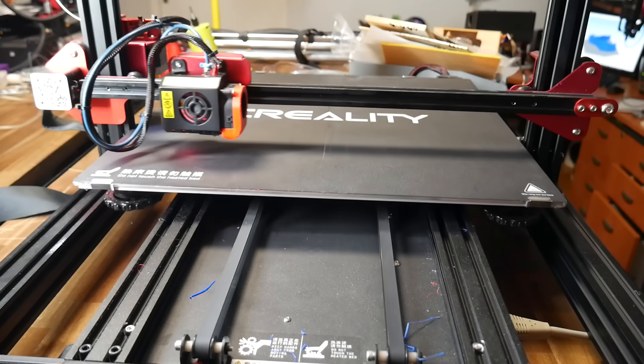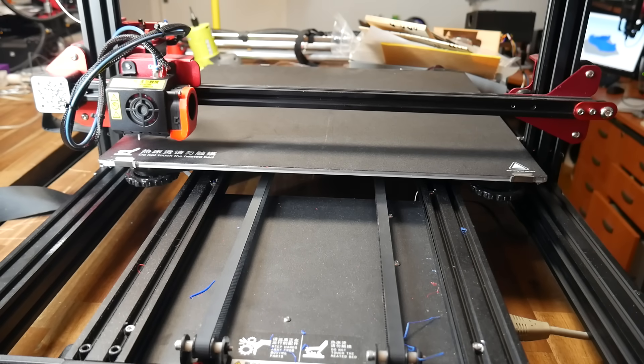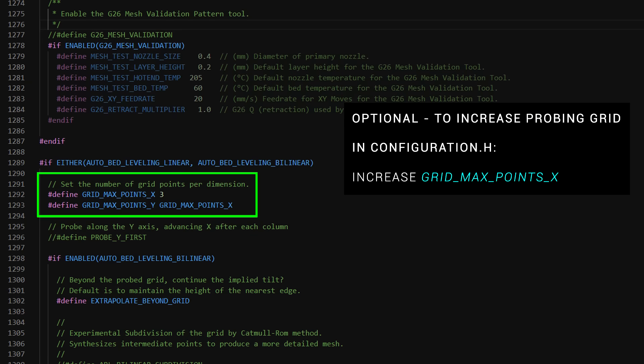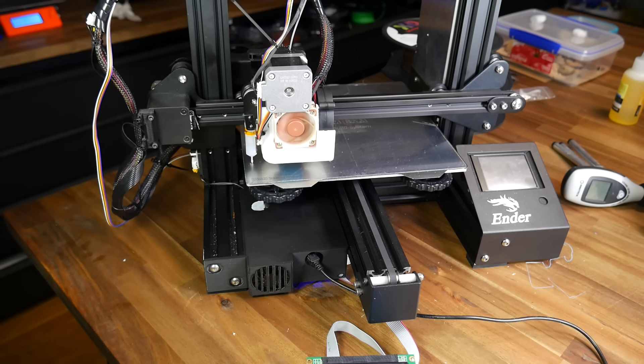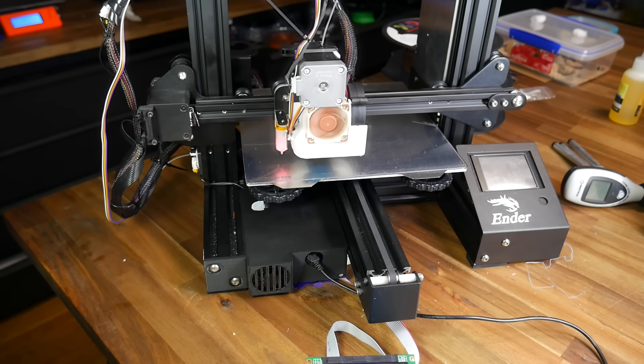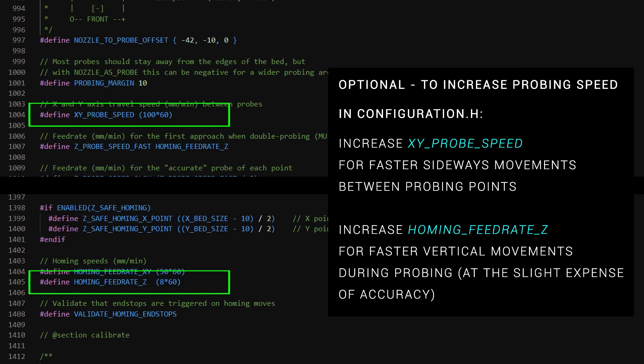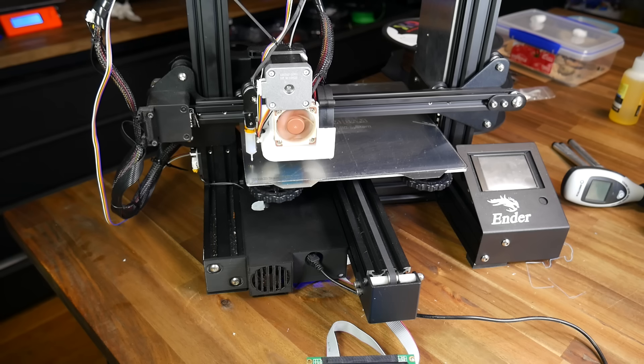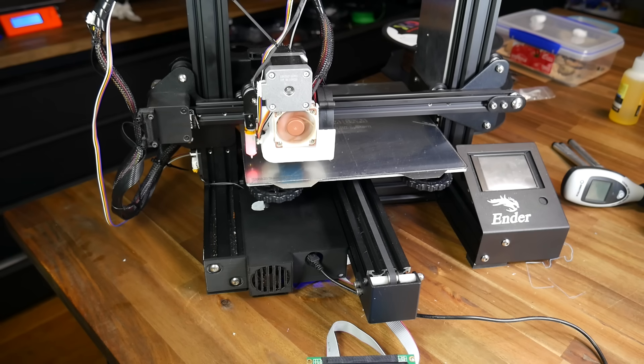Before we finish this guide, how about a little customization. By default Marlin will probe a 3x3 grid of the bed, but if you have a larger format 3D printer you might want to increase the resolution — this is really easy, just increase GRID_MAX_POINTS_X to a larger number. The probing speed of a BLtouch with default settings is pretty slow, but this is another thing we can easily change. The firmware allows us to find a trade-off between speed and accuracy by changing both the XY speed between probing points as well as the vertical speed with HOMING_FEEDRATE_Z. In this section you'll also find a way to enable multiple passes per probing point with the average value being taken to go towards the mesh.